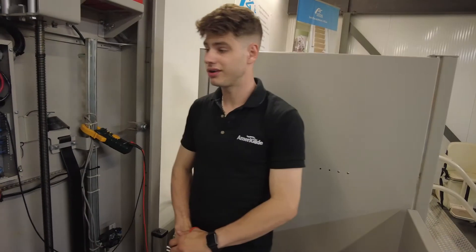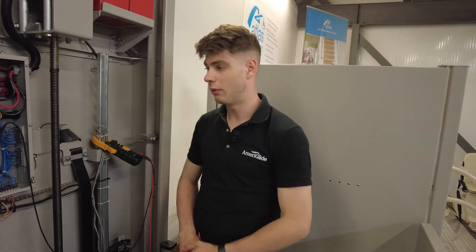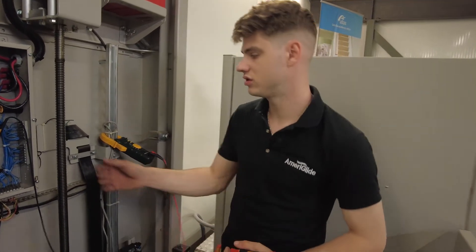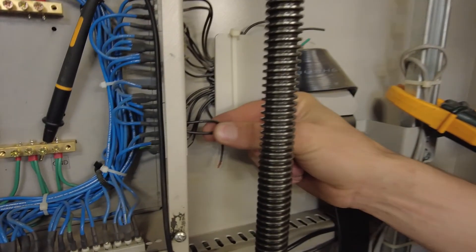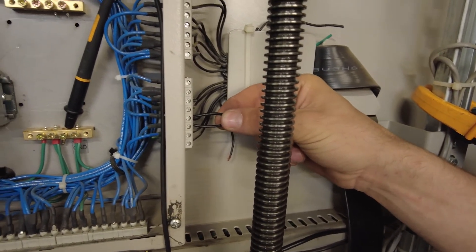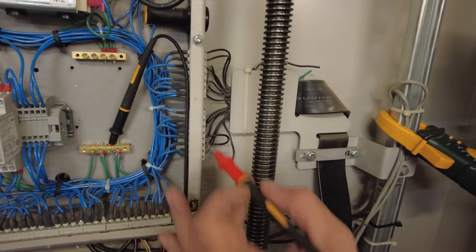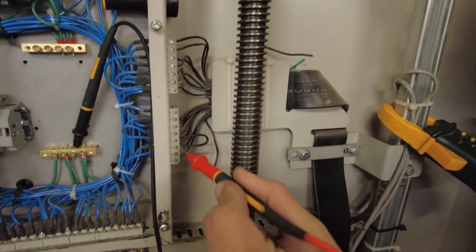On most of our QuickShip units in our residential elevators, we don't have a lower door — we just have the flap. The elevator still needs to think that it has a door so it knows it's safe to take off. On CN16 on the right side, we have a little jumper. This jumper is called I1 — not 11 — I1 for interlock level 1. Since we do not have a lower door, I'm bypassing that circuit, putting voltage on 14 and also 15.